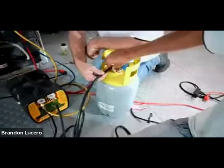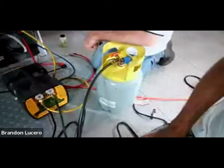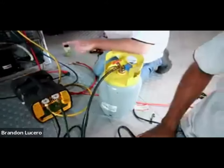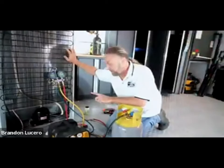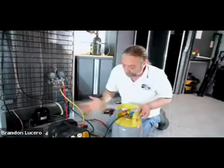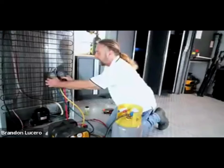Last week I posted videos of someone working on this refrigerator. This was an R12 refrigerator and we took the compressor out, put in an R134A compressor, charged it with R134A, and made it work. But apparently one of the braze joints leaks, so that's why we're in this situation. We go ahead and set this up and turn our gauges back on.